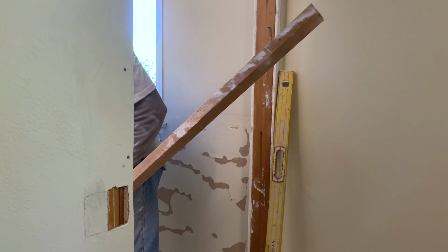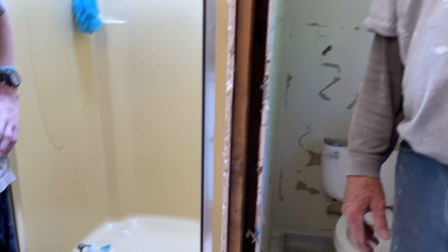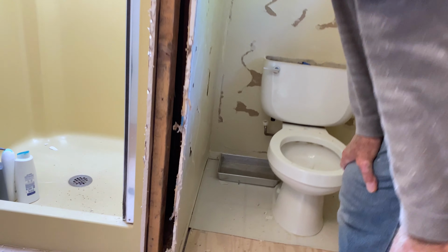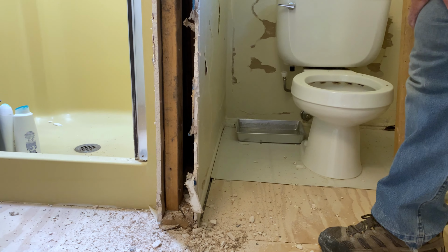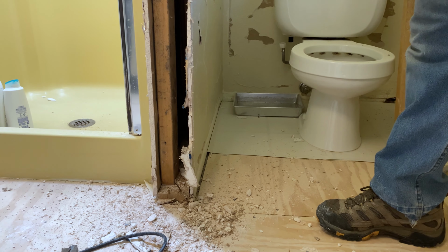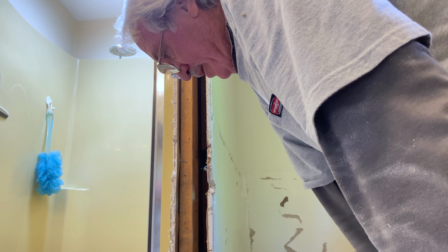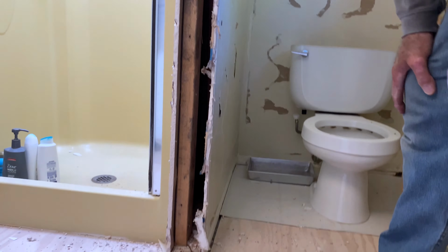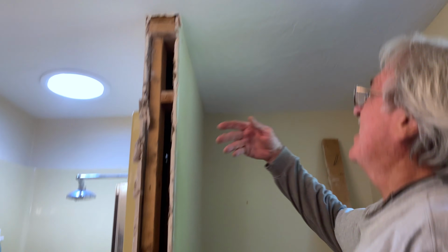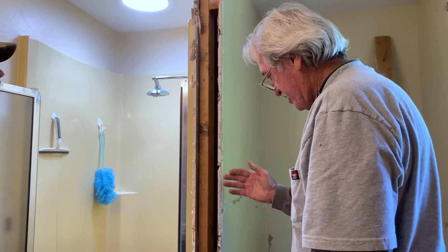So that was something. There's the L. At least the other flat side. How is that? So you can still use your shower. Yeah. Well, cool. So you're actually gonna save quite a bit. Where would the wall end at this point? Right there. Oh, okay. So base plate would be cut back a little bit. Yeah, so what we have to do is rip the stud and tuck it in there and then do the same trick. Nail the hell out of it. Boom, boom, boom, boom, boom. All the way up. Cut that off, which will be a project. So there you go. And then we'll do that, and then we'll cut that off. We'll saw all that whole edge off.